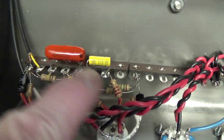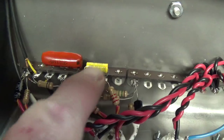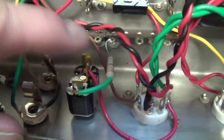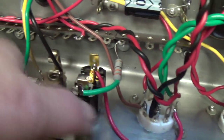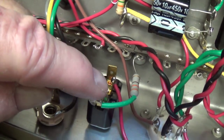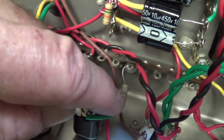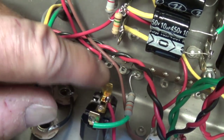Here's the tremolo wiring. Remember that there are three capacitors that form the phase-shifting loop: 0.01, 0.01, and 0.03. They communicate with this tube right here, which is the tremolo tube. The cathode bias switch has been wired to the socket — that's the cathode pin — comes over here to the middle lug. Depending on which way the toggle is flipped, you'll get either the cathode bias resistor suitable for the 6V6 (I'm going to start with a 330 ohm resistor as shown in the schematic and adjust if necessary), or down here for the 6L6.